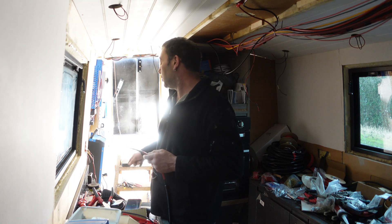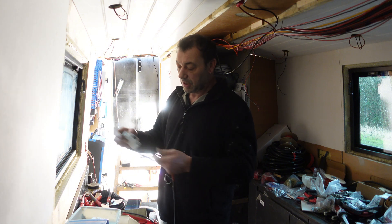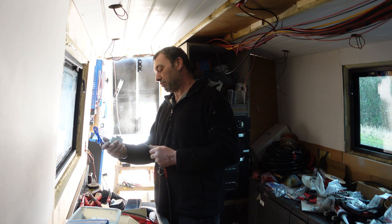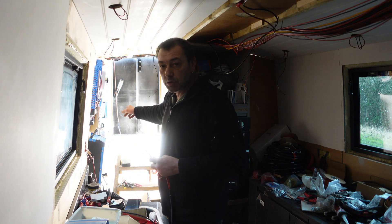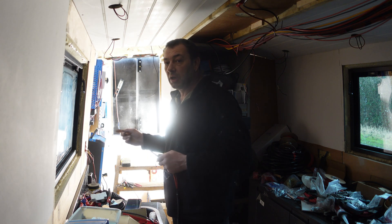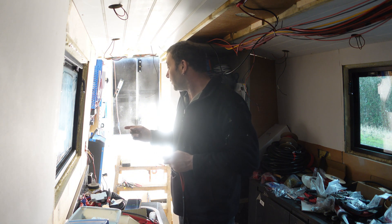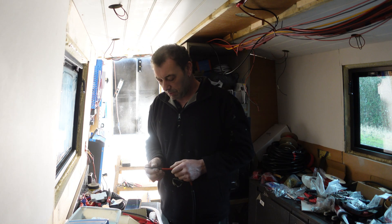Basically I'll be going AC2 up to the consumer unit, where I've got just another — an RCBO — a 16 amp trip with an RCD built into it. I'm going to wire that in, so then I'll go AC2 up to that, and then back down to my fuse spur and then to the calorifier immersion heater. That way if it's on shore power it'll get powered from AC2. And then once my batteries get up to like 95% — if I'm not on shore power — I can program it so it'll solar dump. But that's something I will be doing — probably just put wires in place and then get the unit programmed.